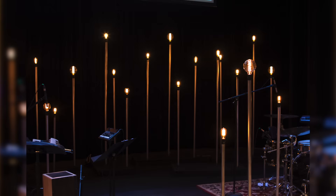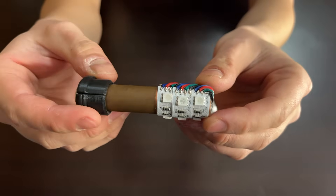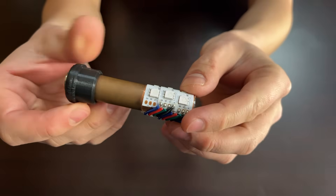For the next set of lights, I made a bunch of light bulb looking fixtures on stands. We were going for this kind of Edison bulb look, but I wanted to have the ability to change the color too. I was surprised to find that there are no ready-made RGB bulbs with this type of Edison bulb look to them, so I had to make them from scratch. I ended up making the bulb filaments by taking a bit of copper tubing and wrapping three segments of the LED strip around it and soldering them together.